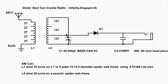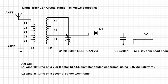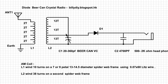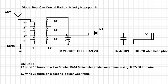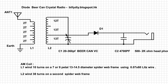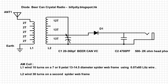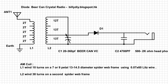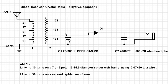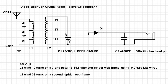If you want to use a MOSFET like 3DQ or 3SK143-Q, use 1/12 of the coil counting from the ground to connect to the S-pole of the 3DQ. You can refer to my DIY blog for how to make 3DQ circuits. The variable capacitor for tuning is made of two beer cans sliding in and out of one another.